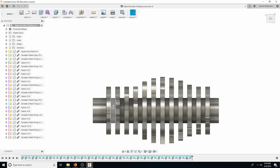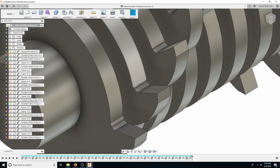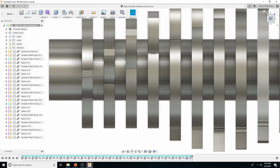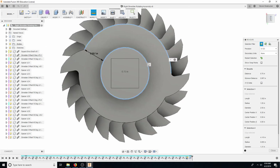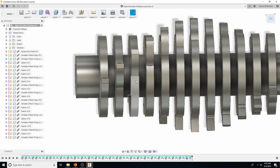So a ball end mill will go in, and then maybe I could go with a square or a bullnose. Maybe I could just go with a bullnose, no, because I don't want this to be that way. I'm going to have to think about it. I'll probably do square, but obviously if you do square, you can't have this, unless I have a small little bullnose. If I have a small little bullnose, there's going to be a radius in here, so I'll have to see if the teeth are going to clear. But the teeth should, because this basically goes up to this point here, and then the teeth go in half an inch. There's way more than half an inch here, almost 0.1 inch more. So maybe it is a good idea to have a bullnose end mill go in there.